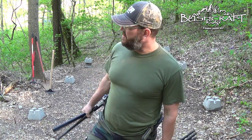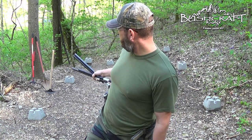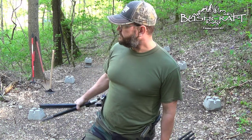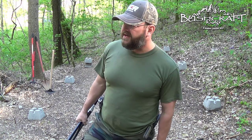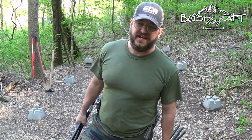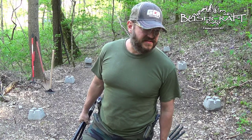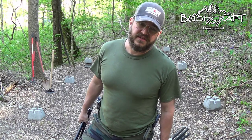If that goes well, we'll tamp them down, put in some gravel at the bottom of the hole, pour a little bit of concrete into the pads, and then just see where we get today. I'm going to do another one of those long videos, and I'm not going to talk throughout it. So I'm just going to do what I do and let the video record it.